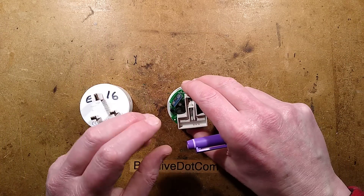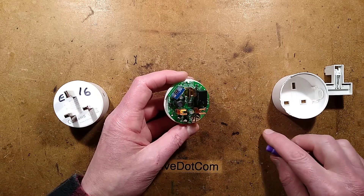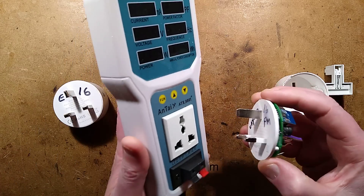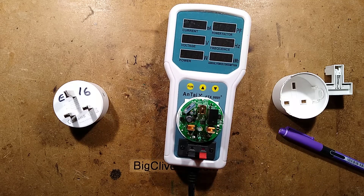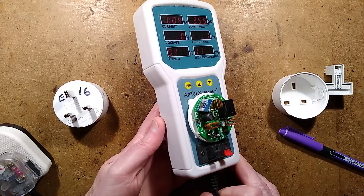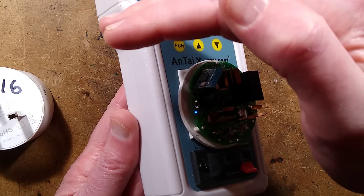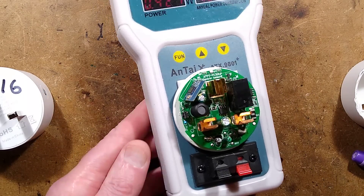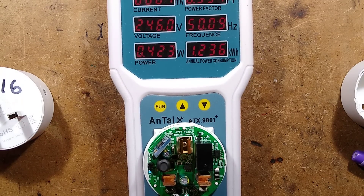Let's take a look at the circuit board. This shroud comes off to expose the socket connections. I'll plug this in — it's not plugged into the mains yet. Now making everything live, the first thing that happens — can you see the wee dim blue LED? It's apparently supposed to be a lot brighter and it's just staying dim and not operating. Out of interest, what's it drawing? Roughly oscillating up and down around about half a watt, but it is faulty.